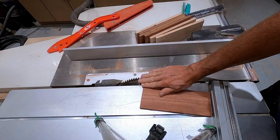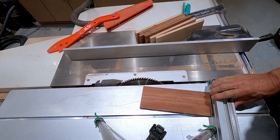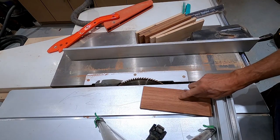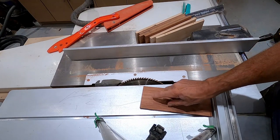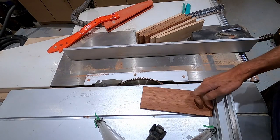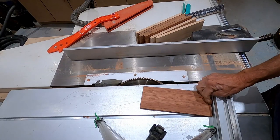Okay, so I got the blade of the table saw set over at 22.5 degrees. I've got this fence bar set at 8 degrees, but I couldn't really work out how you're supposed to work it out. So literally I just did it with that plier, trial and error. When it's cut, the thin end of your wedge is about 30 mil across at the thin edge, and you're about 80 mil at the widest point. And that's about 250 mil long.